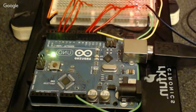powered up. Now, when you unplug the data cable to the Arduino, as long as the Arduino has power in any way, whether it be just a plain USB cord that has power but no data, or a battery pack or a wall plug, once you disconnect that data cable, that Arduino will continue to run that program over and over and over again until it loses power.